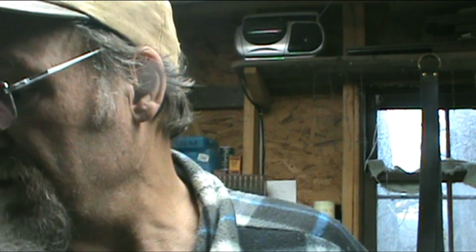So that's what I've been doing, and I was checking my, I just have a piece of angle iron for a platen on this thing, and so I thought, well, you can buy a glass platen for them. So I thought, well, I've got some glass that's pretty tough. It came out of a window that was on a golf course. It broke, but anyway, it took a lot of pressure to break it. And it's a quarter inch thick, or a little thicker. So I figured, well, maybe that'll take a while, not break. Give me a good solid surface to keep the belt from getting into the metal, which it will. The back of the belt will start eroding your metal platen.